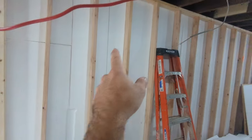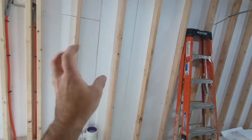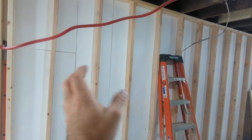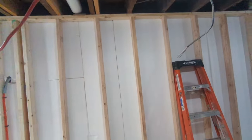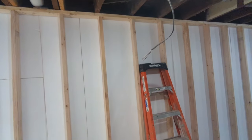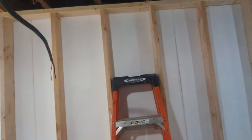And once I know where that's coming from, then I can go up to wherever that enters and glue in that reducing sanitary tee and lock that leg all in. And then from there up to here and over and up and over this way will come after that. So I'll be up in the cupboard and down here back and forth quite a bit. I may need to get Ed's help. I don't know how much camera work I'll get to, but that's sort of the plan.